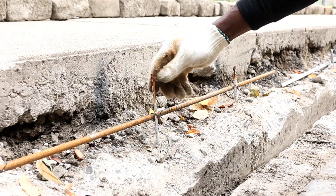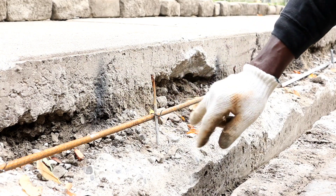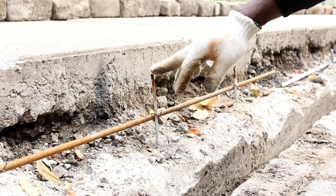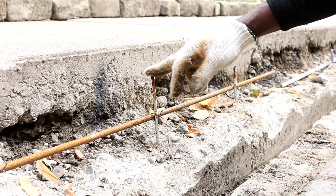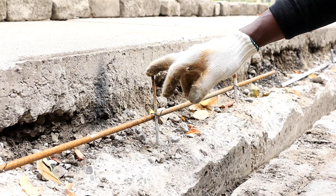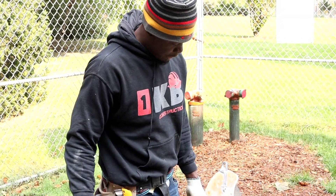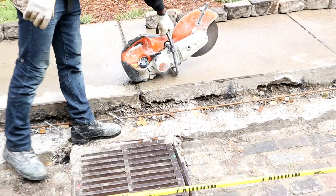So guys, as you can see the tops of these have started to corrode and rot. We're going to cut them off here and cut that one off as well. We're going to go through and cut them all off because we don't want them to bleed later into our new concrete. Now we're going to start to cut the heads off our rebar.